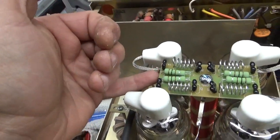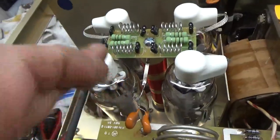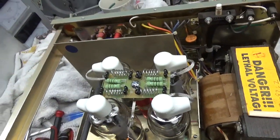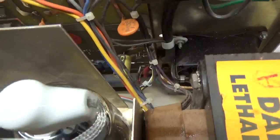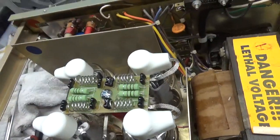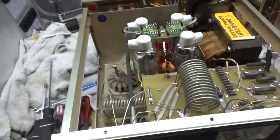This material frays right here - not good. New plate choke. This thing's all set - full output on all bands. Does not have the MOVs. When you have the gas discharge tubes, those can come out. And SO239s are good.